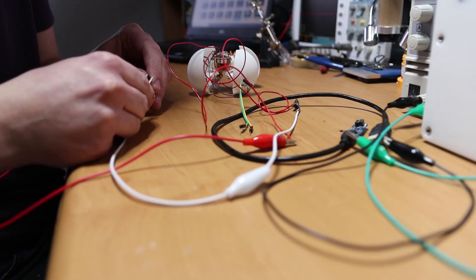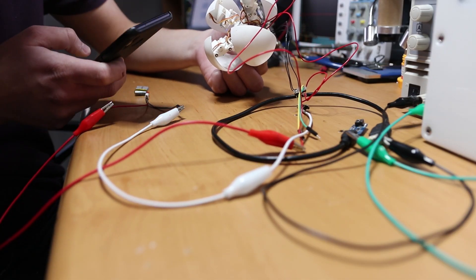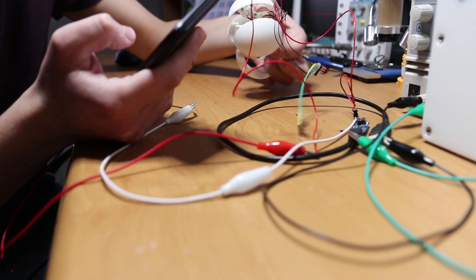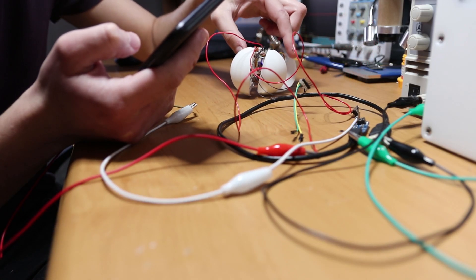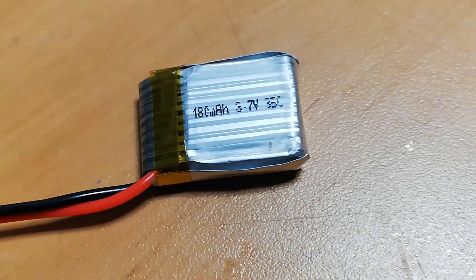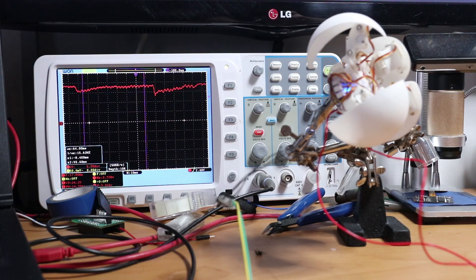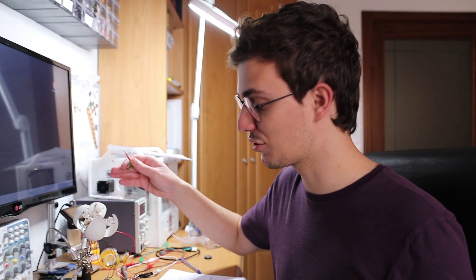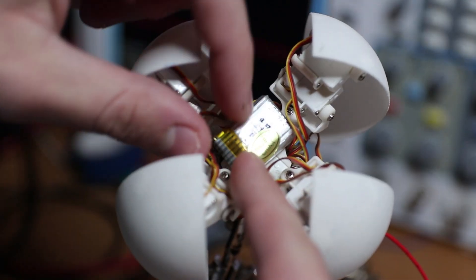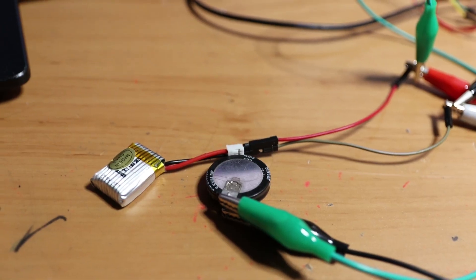Charging is fully complete, let's try it again. Something is definitely not right with the ratings of the battery — it's listed as 5C here but the current limit protection is definitely kicking in. This is a huge problem because I designed this robot around this battery and it fits perfectly. The first thing I tried was adding a 4F supercapacitor, but it only managed to smooth things out. Another option is connecting two of these batteries in parallel so that the current load will be shared, but I only have one and don't want to wait two more weeks for another.